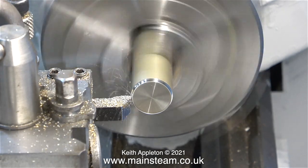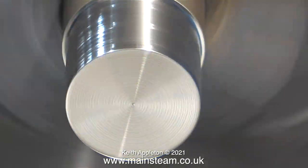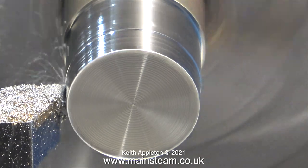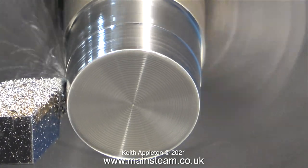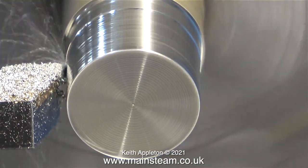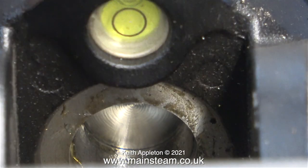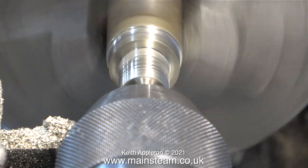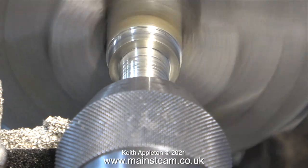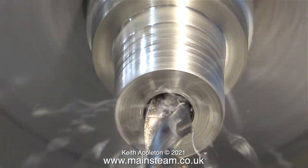This is turning okay — it is at least looking shiny — but if you look closely you can see that it's looking a bit bruised. I'm going about this job in entirely the wrong way really; I just wanted to show quite a lot of machining operations over a longer distance using alum bronze with a tool that isn't sharp. In no time at all I turned the alum bronze to fit into the hole in the camera mounting, and I turned the centre part all the way down to 16 millimeters. As you can clearly see, the finish isn't all that good on the 16 millimeter turned part.